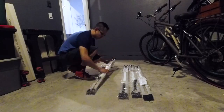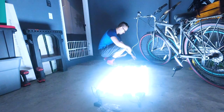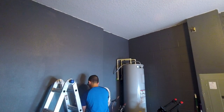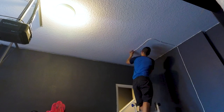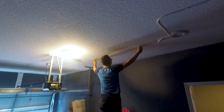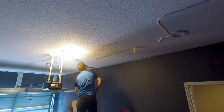Having a good set of lights is so important in a workshop. The ones we got are also from Amazon — I'll link the item in the description below. The lights had the ability to daisy chain to one another, which was great because our garage only had one outlet. We ended up routing our extension cord up the wall, across the ceiling, and connecting the first light fixture. A neat little trick I picked up was to use tape on the back of the light fixture, mark where the mounting holes are, and simply drill through the markings. I repeated the same process for all four light fixtures.